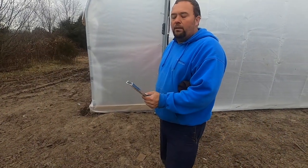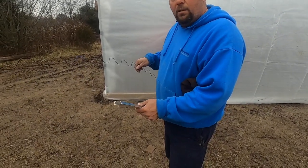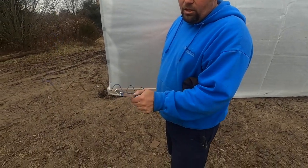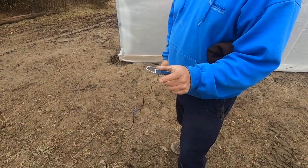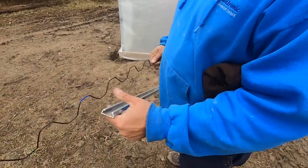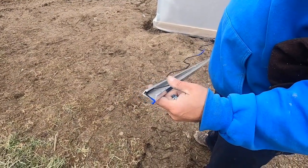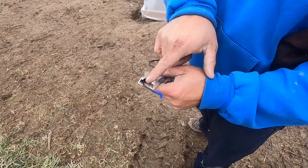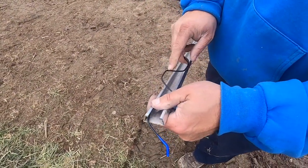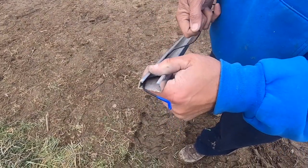So one thing I wanted to add, you guys saw me up in the bucket doing things I don't recommend you should do. But what I was doing is putting this channel on. This channel is what holds the plastic or the top. And then they have what they call a wiggle wire, so you'll tuck your plastic in there, and we'll show you once we get to that point. And then you put your wire in there, and what it does is it'll capture it against the sides, and you just wiggle. They call it wiggle wire because you wiggle it back and forth. So you bend it this way, then you bend it the other way, and it'll go into the channel.